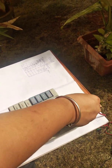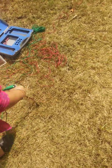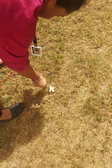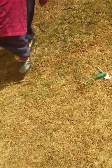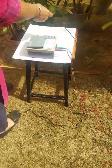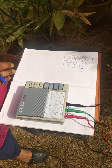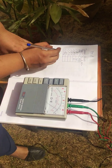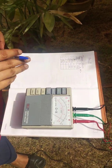Click on 'Off', do the battery check, disconnect the black terminal, and then move the potential electrode to the next reading point. Connect the green electrode, then connect the black terminal again. Do the battery check and click the measure button. The value of R has now increased to 8.6 ohms for the third reading.